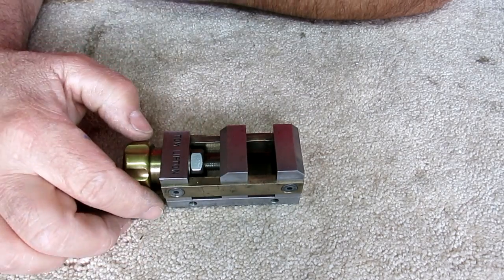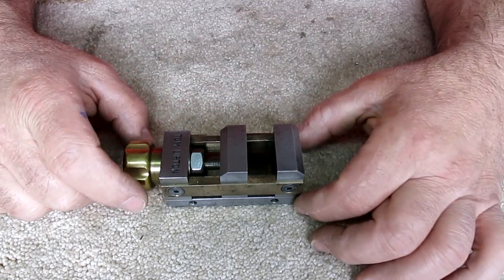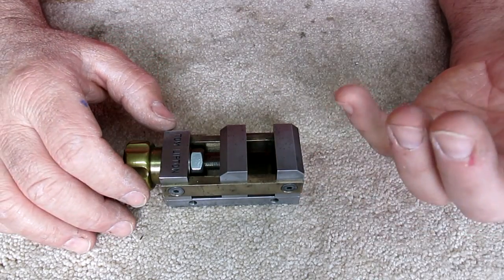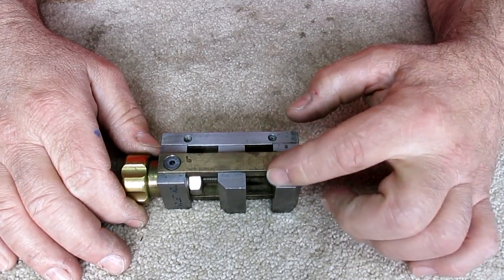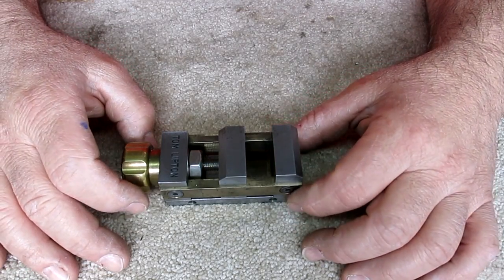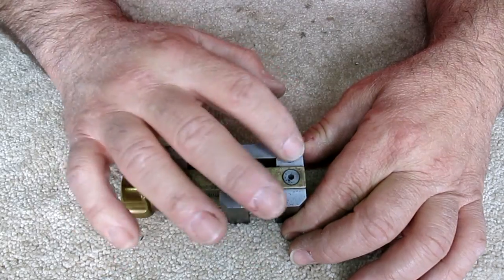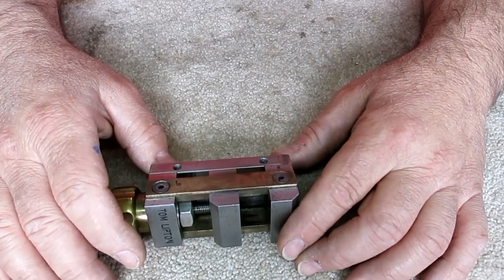Well, what he was doing was he was soldering a connection of some sort. I don't even remember what it was. Guess what kind of flux he was using? It was some kind of nasty acid flux that really attacked this thing. He had it for a day or so, and the stuff really got in there and actually pitted the thing pretty badly. So, yes, I was pissed.